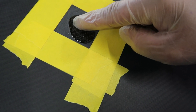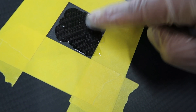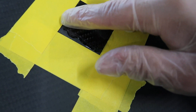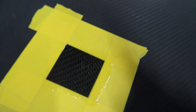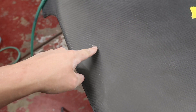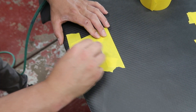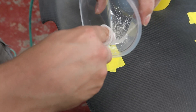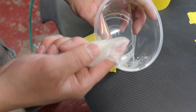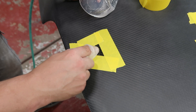We have a nice little puddle sitting there. With a glove on, I'm going to use my finger to push the stuff down to make sure it's really getting inside the crack. Then use my finger to spread it around and get it all even. And I figured why not go ahead and try this other crack too - see if it gets rid of that. With this one I'm just going to put my finger down inside and smear some on since we're just filling really small cracks.